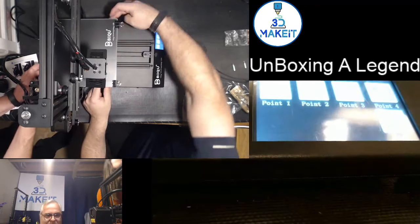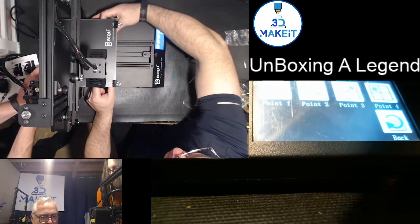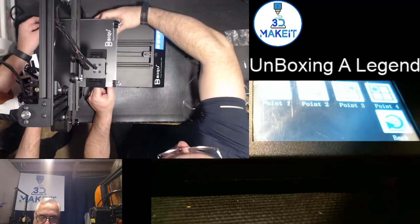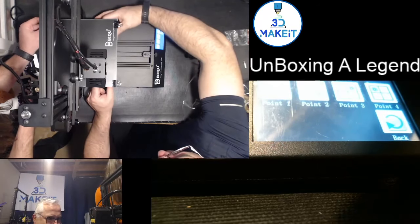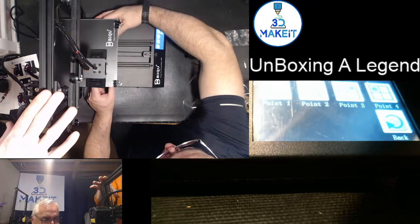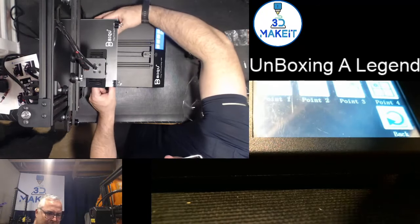Chicken. So, first thing with every bed, and this one's a little more forgiving than those flexi mats on the Enders, but always crank your bed down before you hit level, because you don't know where that Z-switch ended up. And watch as it goes down, because if it's going to crash, you can just tap that Z-switch, which is on the side with the extruder and the lead rod. Are you all the way? Yep, I'm all the way tight.